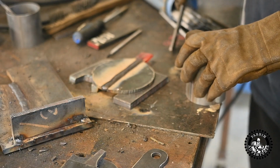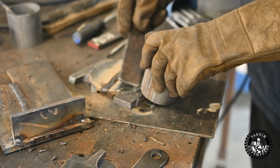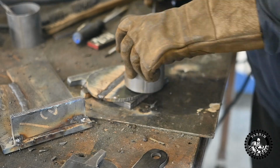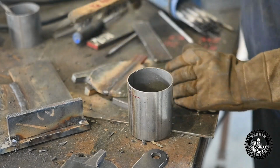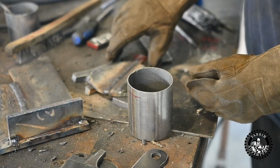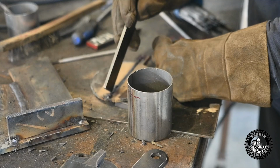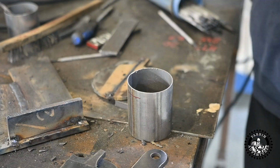That was 180 amps, which is max is what she'll put into this. And you don't need that much probably even. But I like to burn a little bit hotter anyway than some people do. Hot, huh? Yeah, it's hot. It looks great. Now the moment of truth. Well, she's not quite all the way through, but that's to be expected with no bevel on it. Right. Yeah, you only had like an 1/8 of an inch gap there or so.